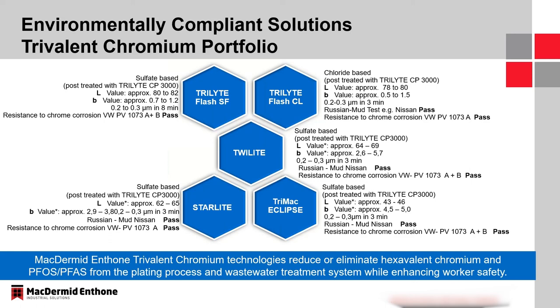These technologies give us the opportunity to reduce or eliminate hexavalent chrome and also eliminate PFAS chemicals. In hexavalent chrome plating baths, mist suppressants that prevent mist from getting into the air contain PFAS chemicals. All of these trivalent systems do not require PFAS chemicals as wetting agents to work effectively. If you're a plastic plater, you still need PFAS chemicals in the mist suppressant for the etch, but you can significantly reduce the amount of PFAS chemicals by switching from hexavalent to trivalent.